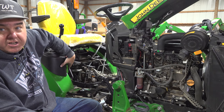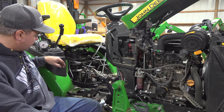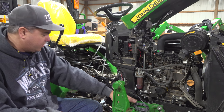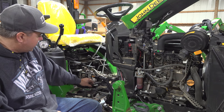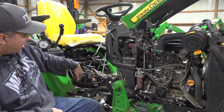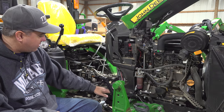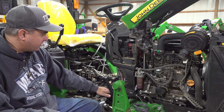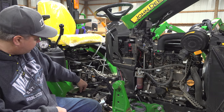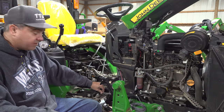We ran the wire here. I'm not going to show you under the fender, but it seems simpler under there — less congestion from the hard lines, and a lot easier to run the wire. It came right down here on the inner side and then splits between power and the control line. I was able to stay on the outside of this main frame. One thing I noticed is there's no way to get through this main frame — no holes to run wires through. So I had to choose whether to stay on the outside or inside. There is one exception: right under this piece here, if you don't have a connector on your wire, there's a little slit about a quarter-inch high that you can slide a wire under. I used that for the power wire. Then I used zip ties to tie it all along here. This lever right here is the brake lever — it's not going to be used very often, but I still wanted to protect from it.